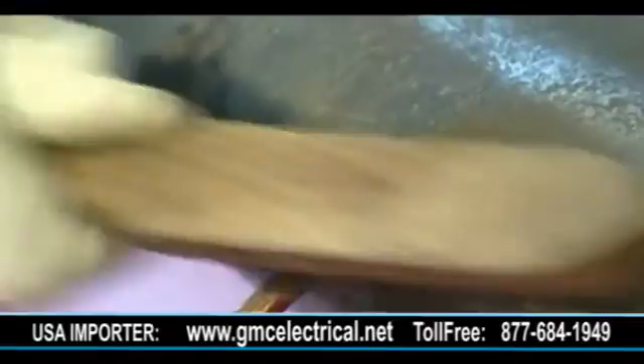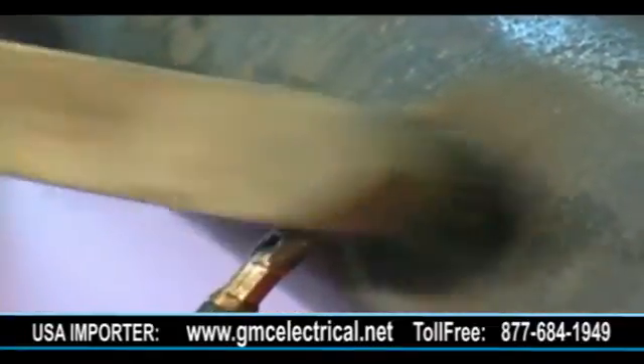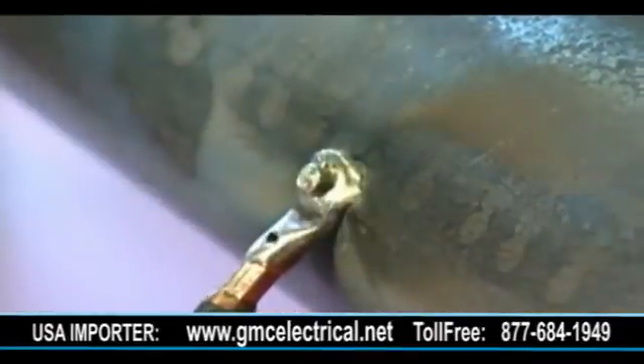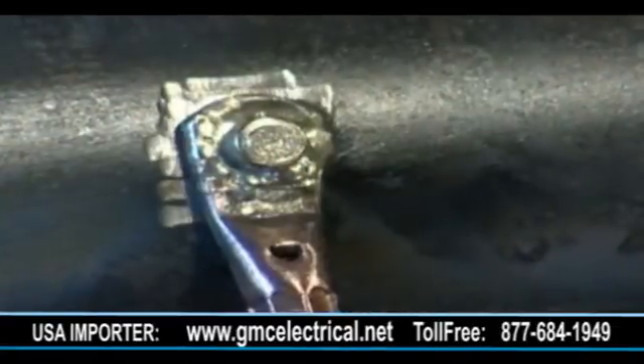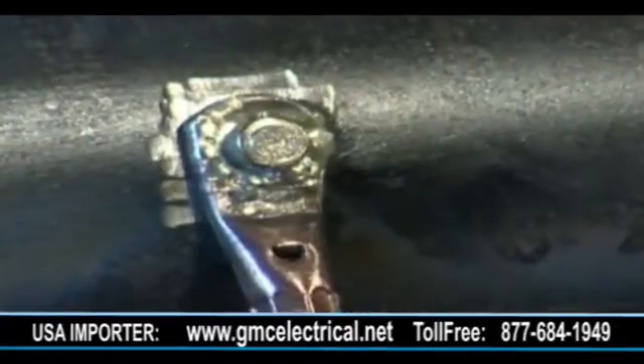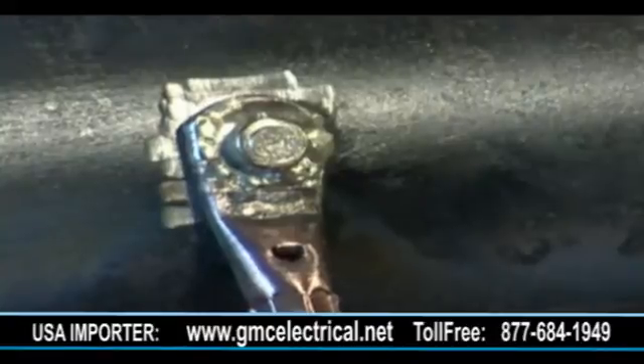Wire brush and inspect. Threaded pins should have an even spread of solder material around their base. Direct pins should also have an even solder pool within the lug and around the lug base. Excess on either side would suggest the gun was held at the wrong angle during brazing. The remaining section of the pin after the shank is removed should not protrude from the surface of the lug by more than two millimeters.